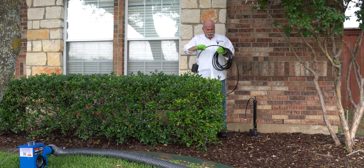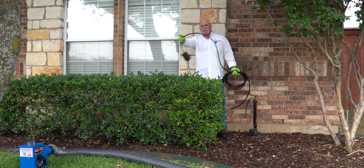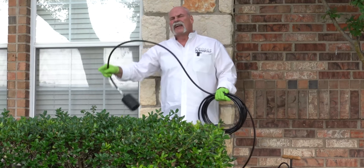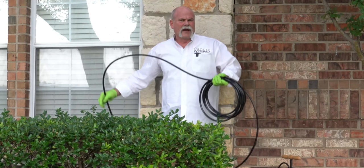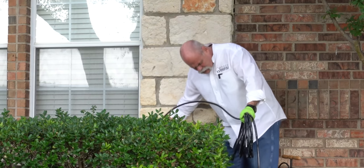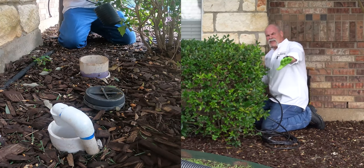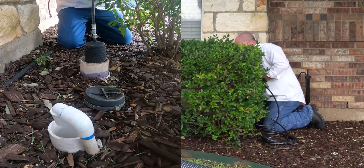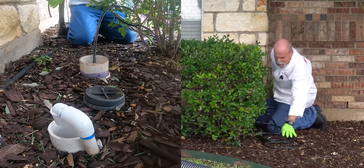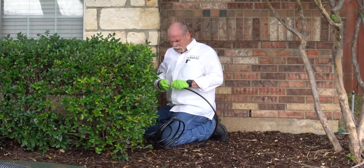So what we're going to do first — you don't need to invent anything crazy. All we're trying to do is make sure that the smoke does not get back into the city sewer main. The reason being I don't want to induce smoke here and have it come up in a neighbor's house. Maybe they do have a dry trap and they've got smoke coming up — now they're worried that their house is on fire or something like that. So what we're going to do is literally just put the test ball down in the two-way clean-outs and point it back towards the main. Once we go past the other two-way clean-out, we're good. All we've got to do is pump it up and that isolates this house from the city sewer main and any other house on the block.